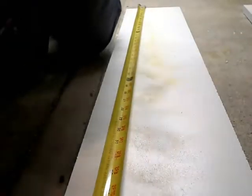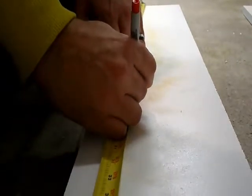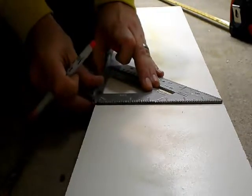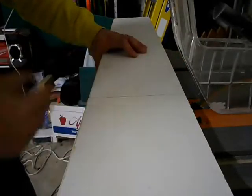Now that I've got my shelves cut to the right width, let's see how long I need each one. We're measuring about 26 and a half inches, so 27 inches will be just about right. I'll take the board we already cut, measure out 27 inches, make a mark, then use my square to line it up and draw a line all the way across so it's easy to read and cut. Line up the saw blade, turn the saw on, and make one smooth cut.